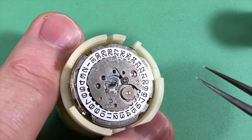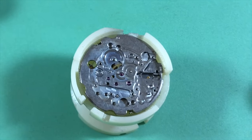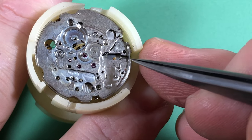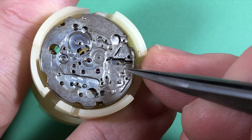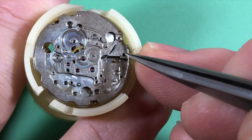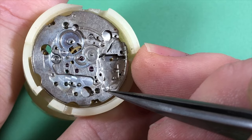This is the front of these world time watches. It's easier to build it backwards because it's not fixed in place like a date guard on a 6105 — it's free-floating, which is why they use the old school warpy spring washer. All this stuff just comes right off. It's dirty, but thankfully no water got in here, which is nice. We got pretty lucky — a lot of times water gets into the crown and wicks up under the setting lever and all the unique material for this movement type, and it just eats the stuff alive. We're very fortunate.